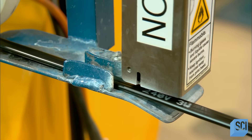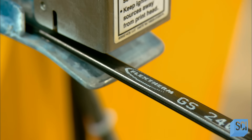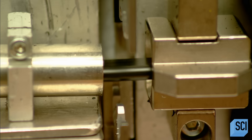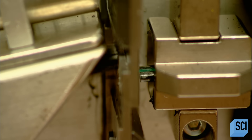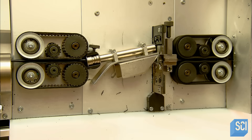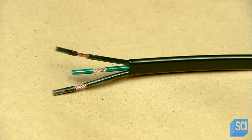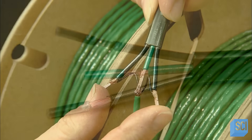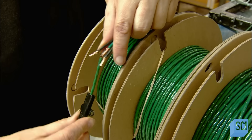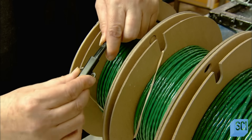Another machine produces the cable that brings power from the wall-mounted thermostat to the heating cables under the floor. It's called the cold lead because it leads to the heating cable yet itself doesn't heat up. This machine cuts the average production run of eight and a half miles of cold lead cable into several cables of standard length — either two or three yards long depending on the product format. The cold lead is comprised of two conductors and a separate ground wire. Workers connect it to the heating cable by fusing conductor to conductor and ground to ground. They protect this junction with a hard plastic cover called a mechanical joint.